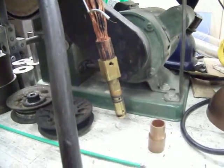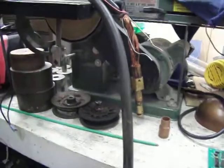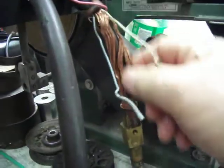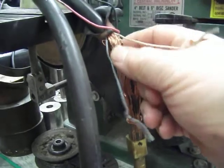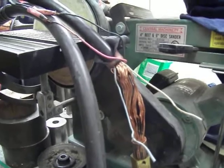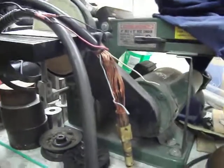So that's what I'll be making — similar to what a flaring tool uses — and I'll crimp them that way. I wanted to show you this because I've seen nothing on YouTube to tell you exactly how to do it. You can see these wires are also frayed and burnt up right in here, and this was kinked right here, which actually bent the liner inside — not a good thing. You don't want to use this cable to pull the welder to another position because it actually stretches or tears the copper wire. So be careful with the cables and pull the welder with a handle instead of the cable.